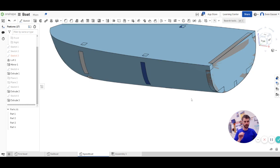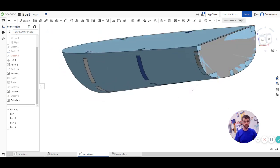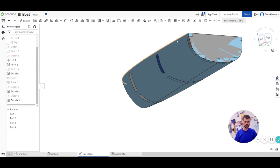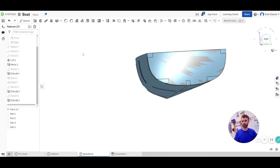In the next video, we'll talk about making the keel and the gunnels and the chine, which are those final 3 pieces. The keel is the part that's going across the whole bottom here. The gunnel is going along the top edge of the hull here. And the chine is where it kind of turns here on the halfway mark approximately of the hull.